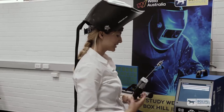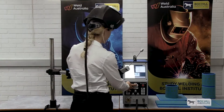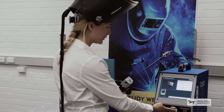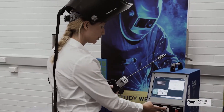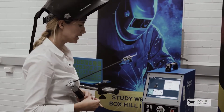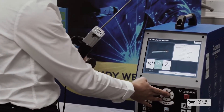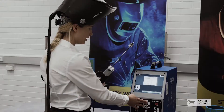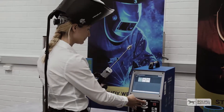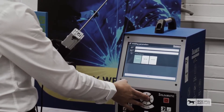The next process I'm going to take you through is the stick welding process, also known as shielded metal arc or manual metal arc. We're going to be doing a fillet weld in a T-joint in the flat position on carbon steel, using a 6mm plate. We'll be using the E7018 electrodes and the 3.25mm diameter wire. We don't need gas. One pass only, continuous welds. And with stick welding, we drag.